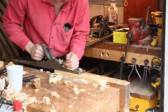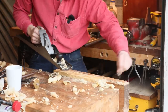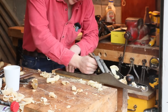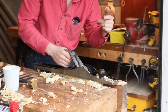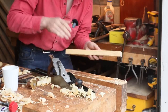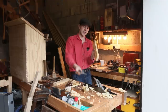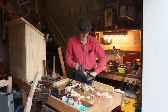Say what you want about using hand tools — there's nothing quite as satisfying as doing it all by hand. Anyone can feed timber through a machine with a bit of training, but you have to develop a bit of skill when you're doing everything by hand, and it's more rewarding when you have everything done. Not to mention a jointer plane like this might cost you one or two hundred quid, while a big jointer table would take up a load of room and cost maybe five or six times as much. For me it's not even an option — I don't have room for a jointer table. So once I have my reference plane perfectly true, I can grab a square and use that reference plane to make sure everything is nice and square.